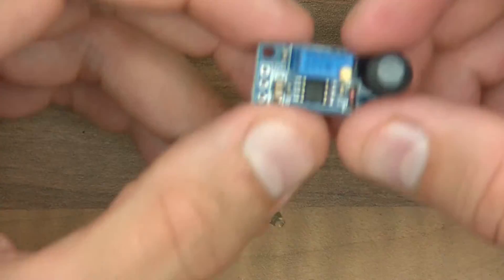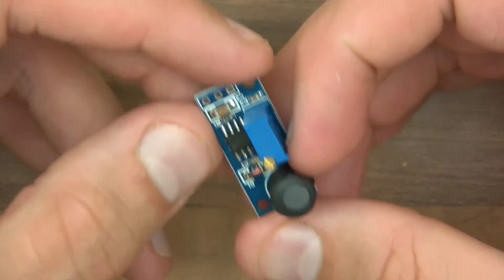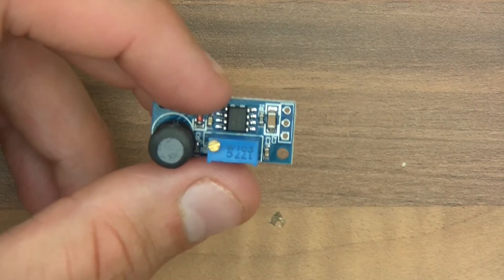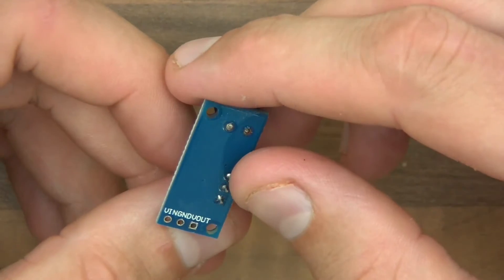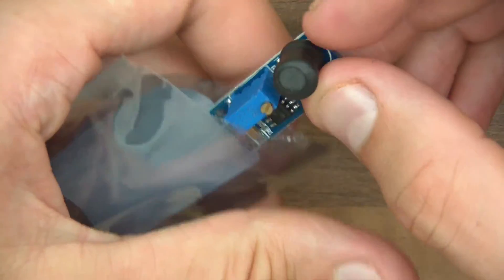Fourth item - it's a chip. It says 063AC made by ST, with a 10K potentiometer - I can tell it's 10K because it says 103, meaning one, zero, and then three zeroes. There's also what looks like an inductor, with pins labelled Vin, ground, and out. I don't know what that is either, but we'll have to find out.